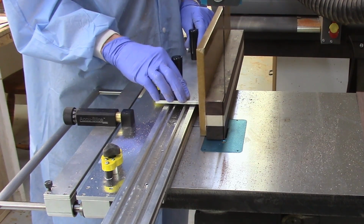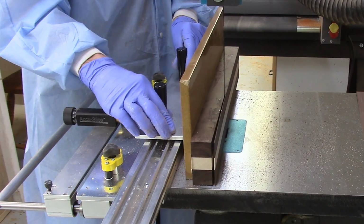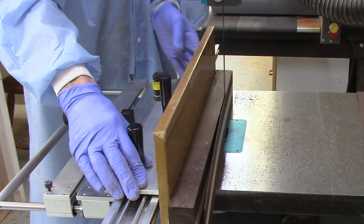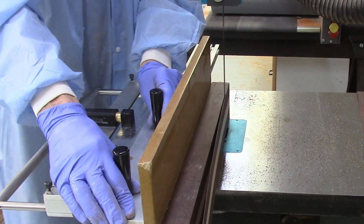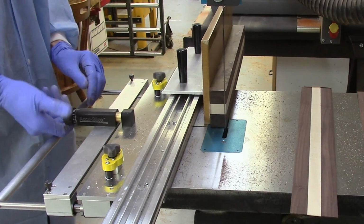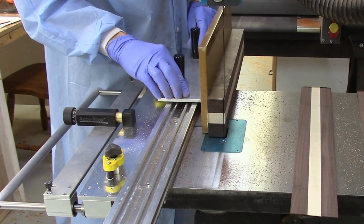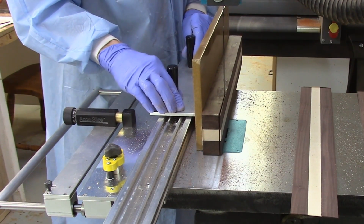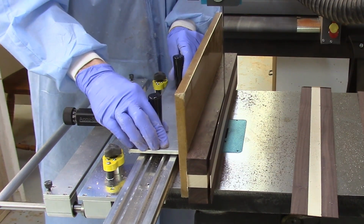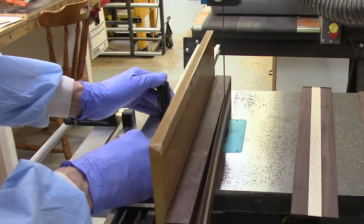The wood inserts for this project can be easily and accurately cut utilizing the Accu-Slice bandsaw accessory. An initial cut is made to square out the surface of the board so that all subsequent board slices will have perfectly parallel surfaces. The indexer is then advanced 50 thousandths of an inch to allow for the bandsaw blade thickness, and then advanced an additional 45 to 50 thousandths of an inch to cut the board to the required thickness for the wood inserts. After cutting, the only sanding required is to sand the edges of the board with 220 grit sandpaper to remove the fuzzies or small splinters on the edges of the board.